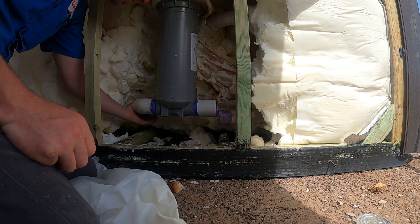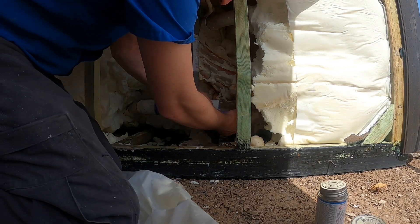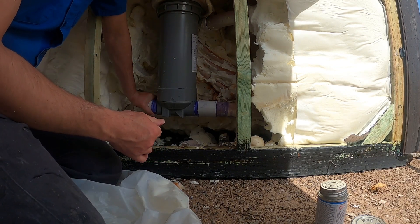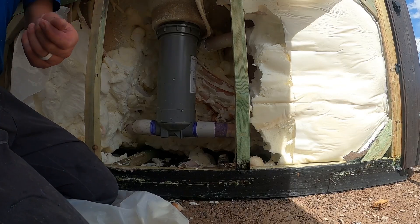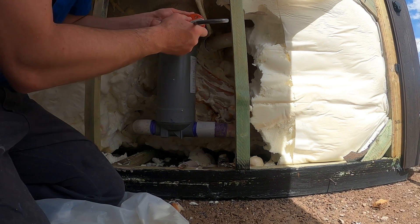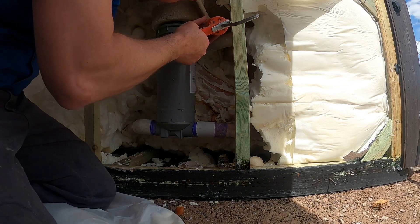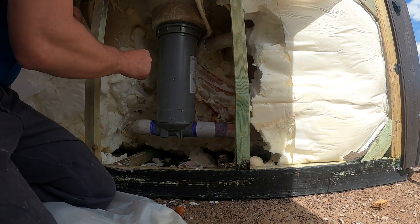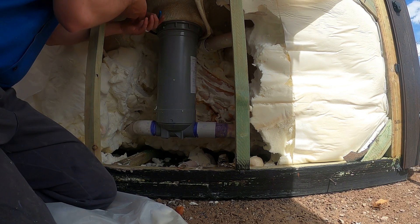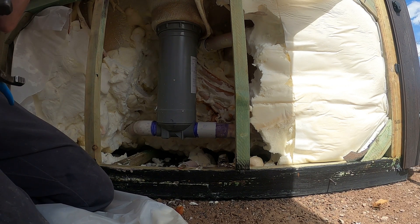This is always the hard part — trying to glue two pieces in at the same time and get everything to line up right. That's the nice part about not tightening down that union nut up there: you can wiggle this filter bucket around to get things into place. The last thing I'm going to do before I tighten up that nut is put a small bead of silicone right up around here on the threads of that bucket. When I tighten down the nut it kind of squishes around the threads and continues running the silicone around. I don't want to over-crank this because we might end up having the same problem that we did before with cracking the top.